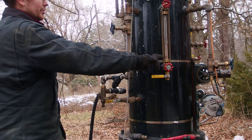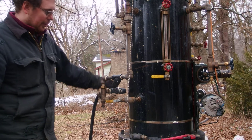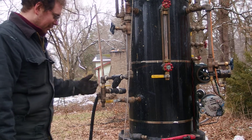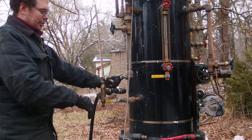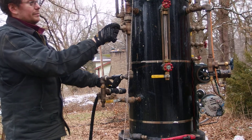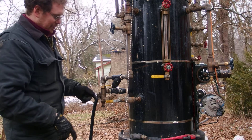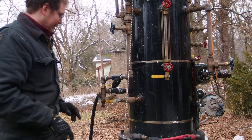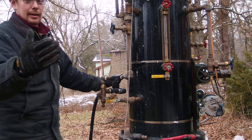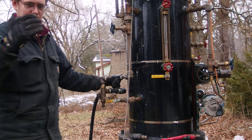What we're going to do is open the water completely and make sure the discharge is open completely — it likes to spit and dribble. With everything open, I go ahead and give it a little steam, monitoring the water level and keeping a secondary eye on the pressure. It'll develop a vacuum, start injecting water, we'll have an overflow, and then we'll react by restricting the water input to keep the overflow from overflowing.